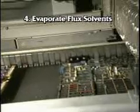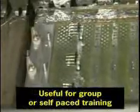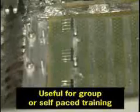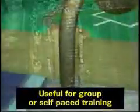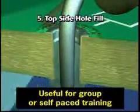The fourth reason for preheating is to evaporate the flux solvents. Any solvent left in the flux upon entering the wave will be heated to its boiling point and can cause blowholes, splatter, and solder balls. Excessive splattering can actually ruin a solder joint. Finally, proper preheating can assist topside hole fill on the assembly.